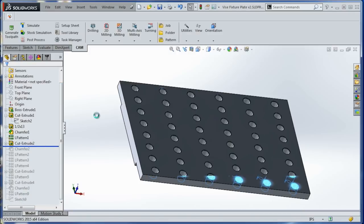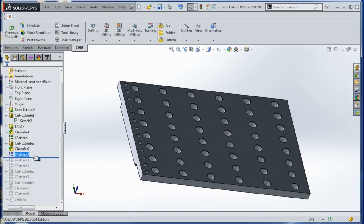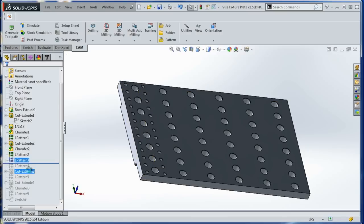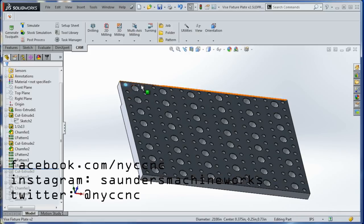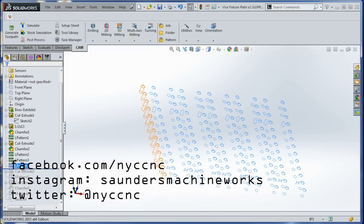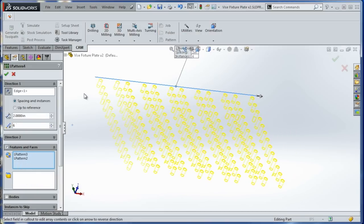And then the same thing, that's a tapped hole, chamfer that just to show it's tapped, pattern that down once. The pattern there is 13 holes that are all 5/8, and then that gets patterned over once. I think that was an inch and a quarter. Then that pattern gets patterned over, so you can see that these two columns repeat once, twice, 3, 4, 5 times. So if we look here, we should see 6 actually, because it counts the original. Yep, 6. That makes sense. Probably a little bad graphics there.